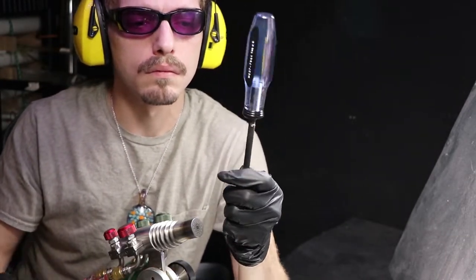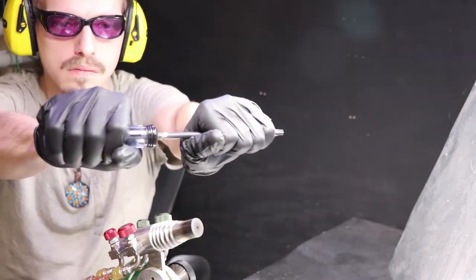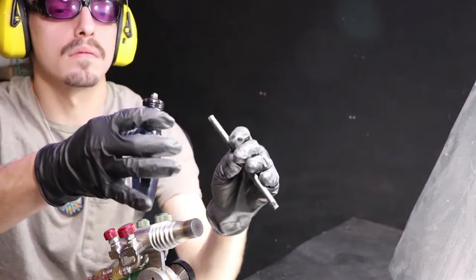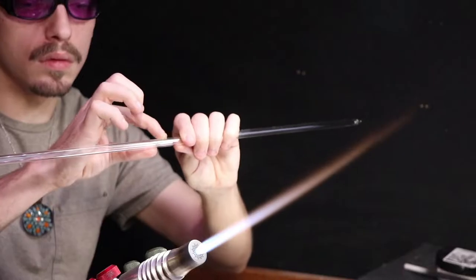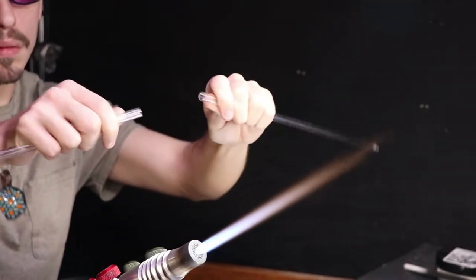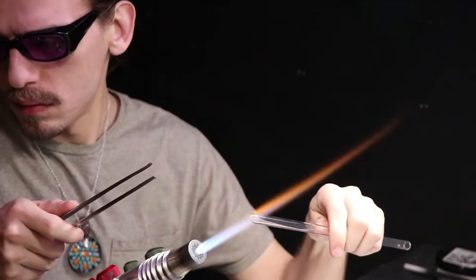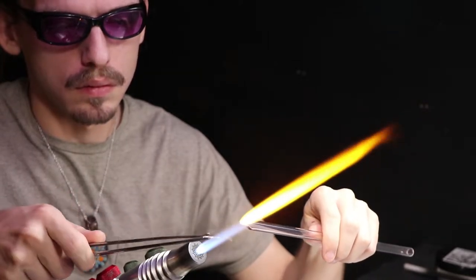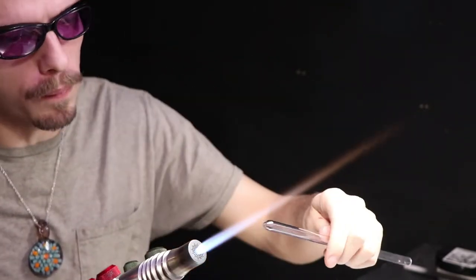Time for Iron Wand 2.0. The solid metal core should work much better than the powder, and it fits the tube perfectly. You can see how clean those edges are. If you plan to use them as blow tubes, they are still sharp enough to cut your lip. So you want to hold them in the flame for a moment to melt down the sharp edges.